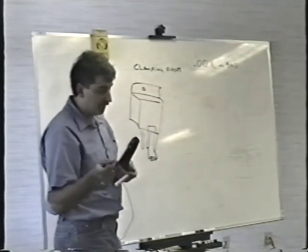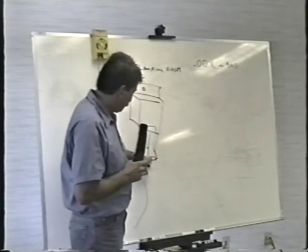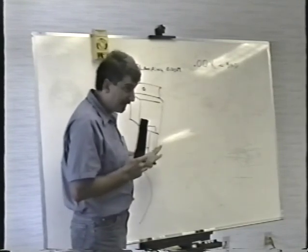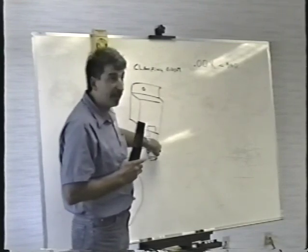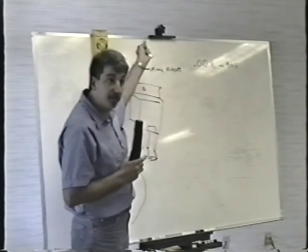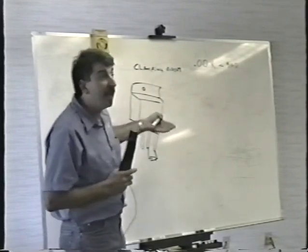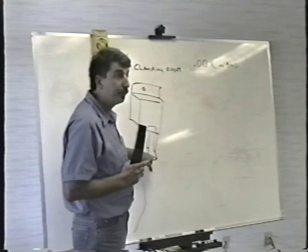And this is important, also check the clamping diode. When the transistor is out, check the clamping diode. You can do it at the same place, at the holes where the collector and emitter used to be. You pulled the transistor out. You can just go on those same two points on your board and check it again. If you still have a short there, the diode is also bad.